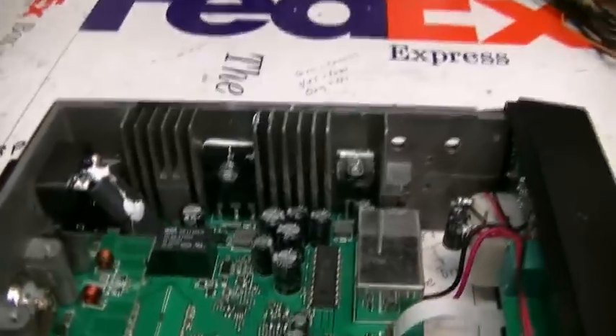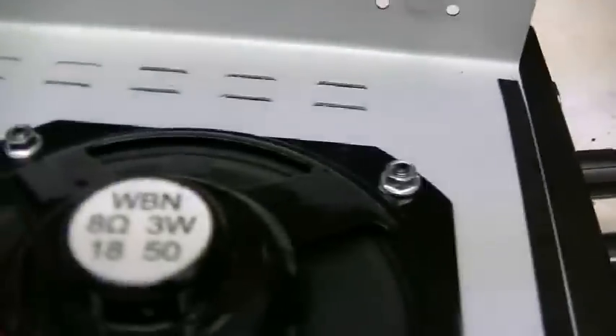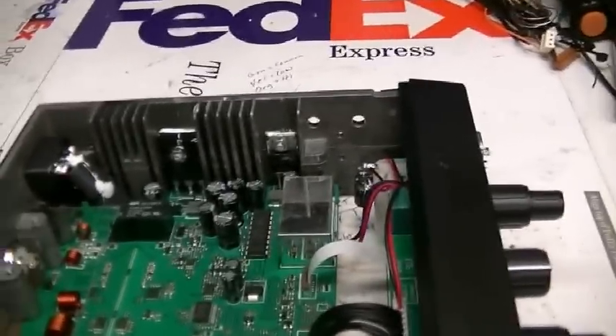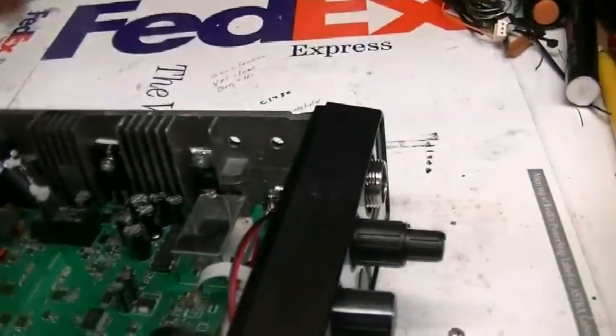Good job, President. I really love the fact that it's got this built-in heat sink. You probably didn't notice, but the covers are vented — see those louvers punched in on each side? They're on the top and bottom covers. What that does is allow air to circulate inside. Hot air rises, so as the air heats up inside the radio, it takes cool air in from the bottom and the hot air comes out the top. It's really ingenious — no fan or anything, just good ventilation inside the cabinet.